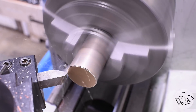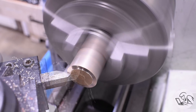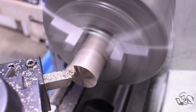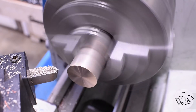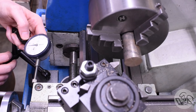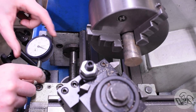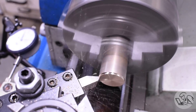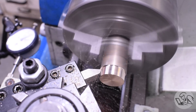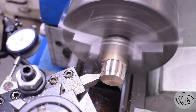Now I will face this off, as is tradition. An easy way to get a precise length on the lathe is to set up an indicator right after facing - you know the tool is right on that surface because it just created it, so your length will be perfect. I'm going to turn down the OD to the outermost diameter of the bushing, and on the second pass - oh my goodness - crazy things happened. Look at that curve it just created.